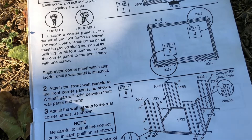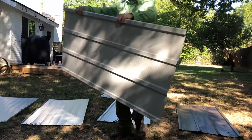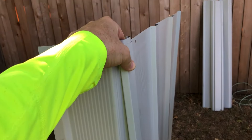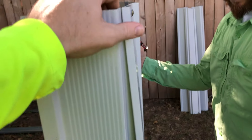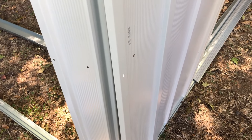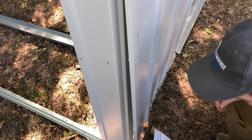We're doing the front — Nathan is getting a 9372 panel for part two of step six. You get that panel in place and it can kind of freely stand. Bring the 9372 panel in and attach it to the corner where we already have one screw. Definitely hold it in place until you get that panel properly attached. The center holes get bolts, not screws — top and bottom get screws, center gets bolts. We'll do that for all four corners, with two screws and one bolt each.